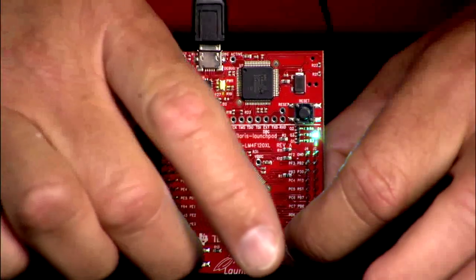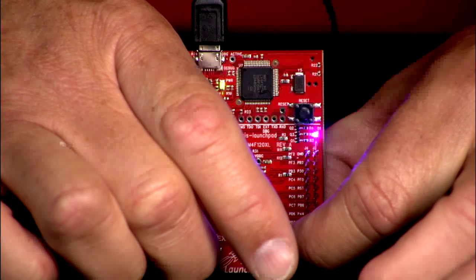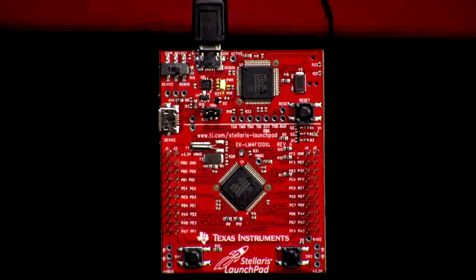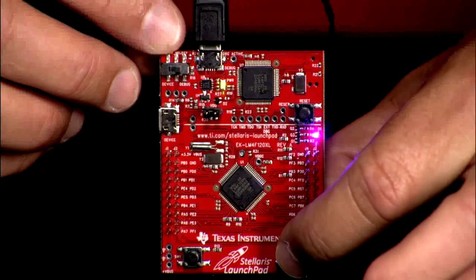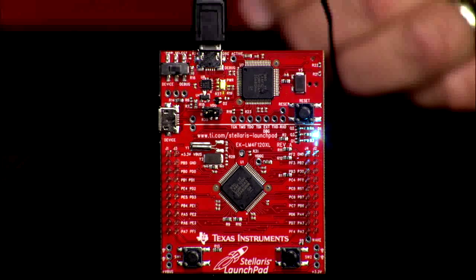In step 31, press and hold both SW1 and SW2 for 3 seconds to enter hibernate mode. In this mode, the last color will blink on the LEDs for half a second every 3 seconds. Between the blinks, the device is in the VDD3 on hibernate mode with the real-time clock running. Pressing SW2 at any time will wake the device and return to automatically changing the color display.